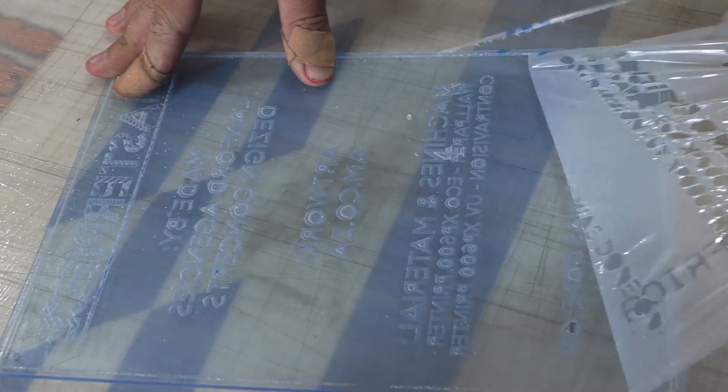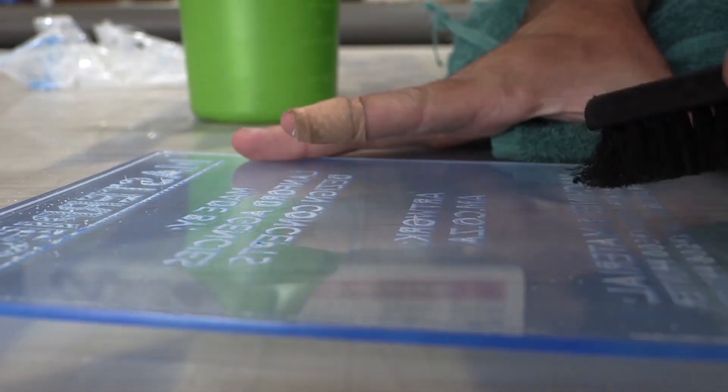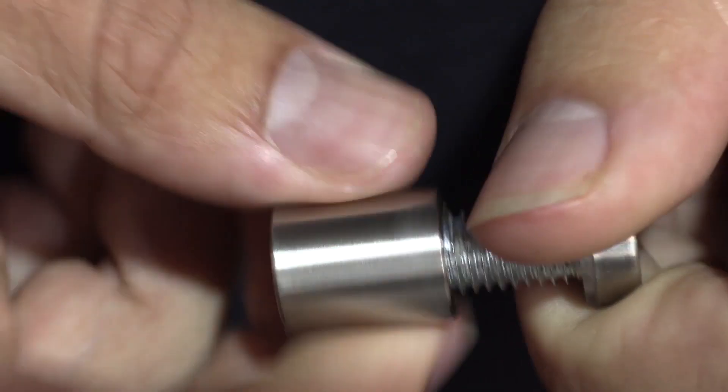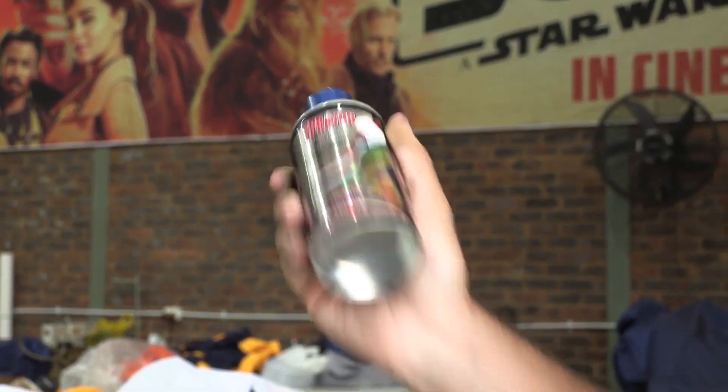For attaching the certificate, we're going to use the pilot holes that were made in our laser program and cut out by the laser machine. Since we didn't know what size risers to use or how far off the wall we wanted it, once we had the actual parts we decided on the hole size and drilled the holes in the perspex. We use steel or aluminium risers to pick it up off the wall, giving it a 3D effect that looks much more appealing than mounting it directly to the wall.